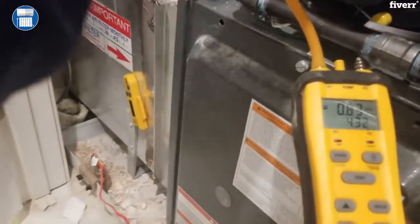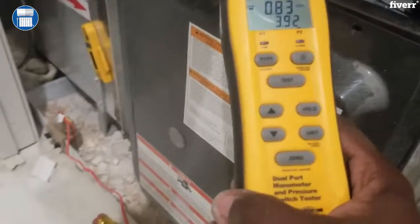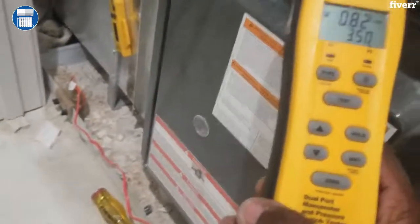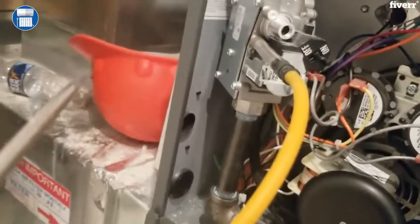Okay, it's just right in there — that's what we're changing — and we're going to look on our meter and stop when we get to the right side. That's the required gas pressure: 3.5. We're at 3.48 — sometimes you don't get it exactly — but 3.55, that's pretty good. This is how you change your gas pressure.